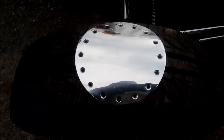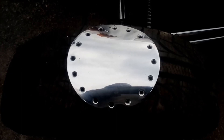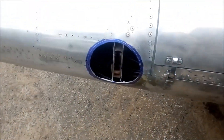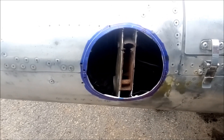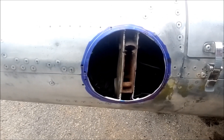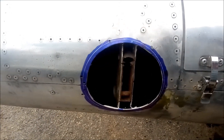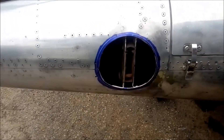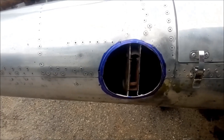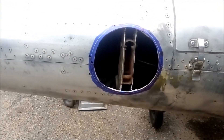This piece came out of the belly of the tank when I was making room for the engine. I saved it because it fits really nicely over this hole. It was actually a mount where it attached to the plane like a strut — really strong. I hacked it out of there but I'm leaving one piece in to keep the tank's integrity. I cut it below level, had a helper hold the piece up, scribed it with Dykem, and now I'm going to grind it back so this piece fits into that hole.